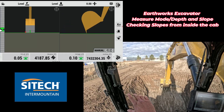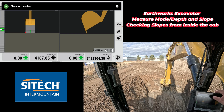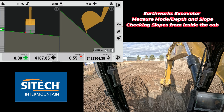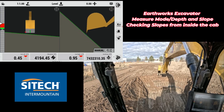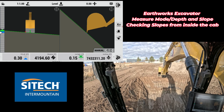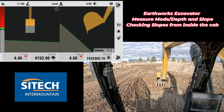Once you've established a couple of slopes, you can come back and keep checking with a bench elevation. For your main fall, turn your slope on in front of you — you're good at the bottom — and drag up to the very top to see if you've hit the mark. Right there, I know that's perfect: a true one-to-one out in front of me.